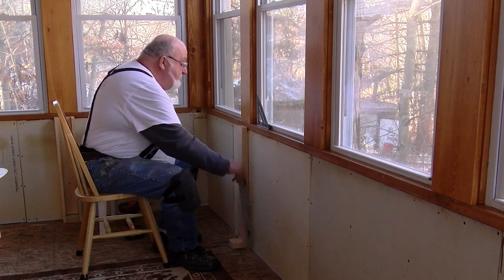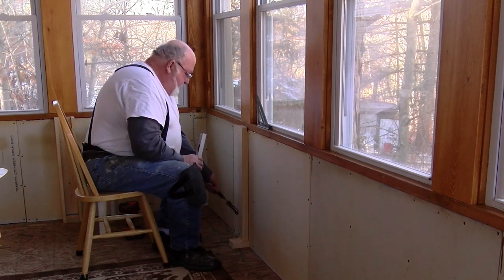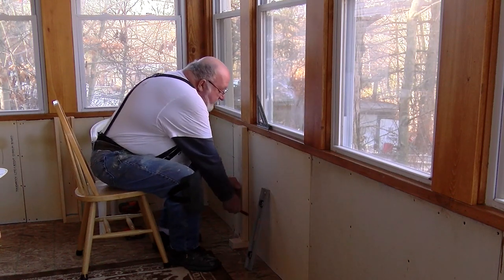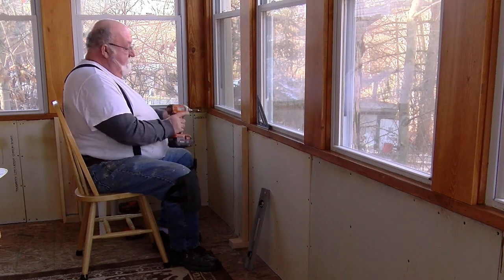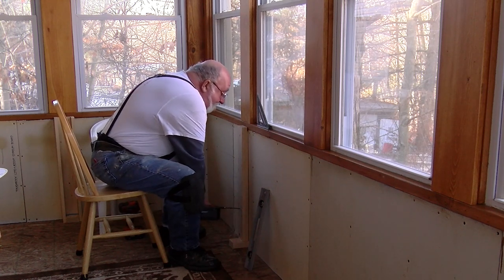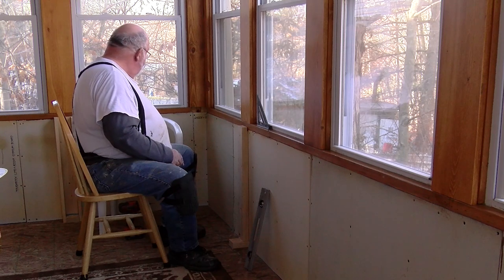I'm going to use a three-and-a-half-inch screw. This doesn't have to be perfectly perfect, so I'm not measuring it, but I'm lining it up where it looks like it's right in the center of my post. Once I get the top in place I'm going to check for plumb. Once I have it plumb, I put a pencil mark here just in case it wants to move on me so I'll be able to realize that. I don't need to pre-drill the next hole because I'm not very close to an edge.